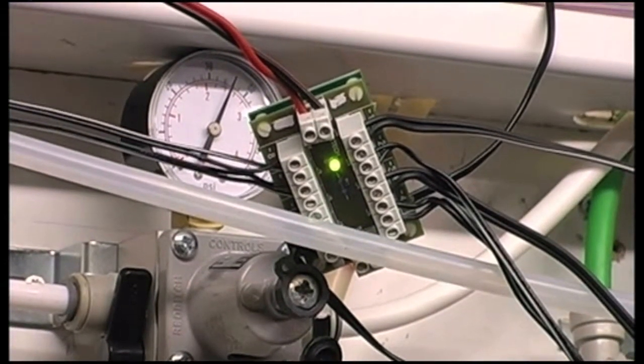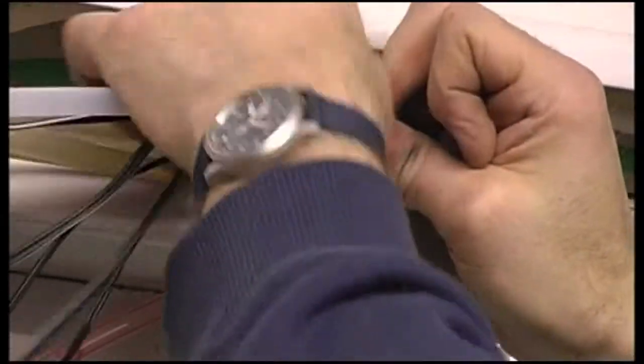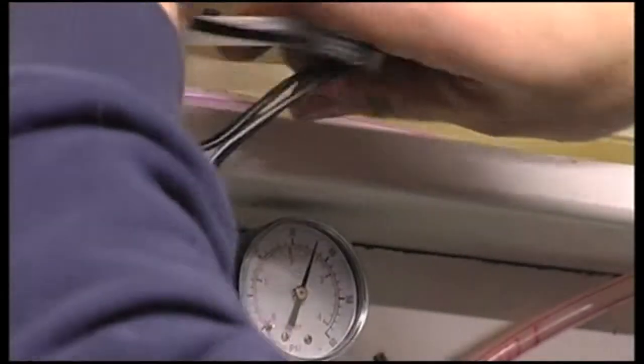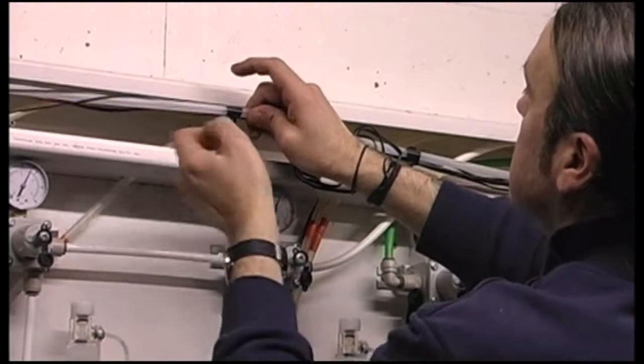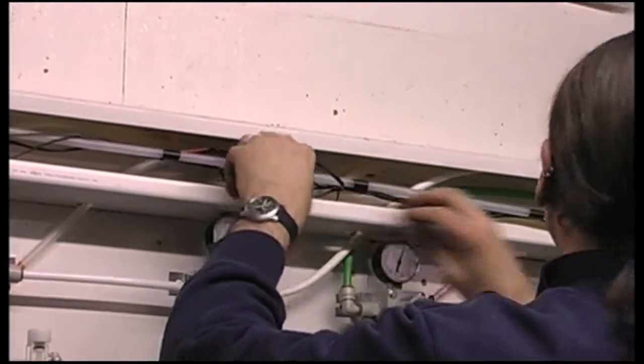Once all the units have been connected, it is advised to tape all the cables together along a beer pipe within the trunking, again making it safe for anybody that may also have work to carry out within the trunking. Once satisfied that all the BeerTech conditioning units have been successfully connected and all are showing their green LEDs, the trunking covers are then replaced.